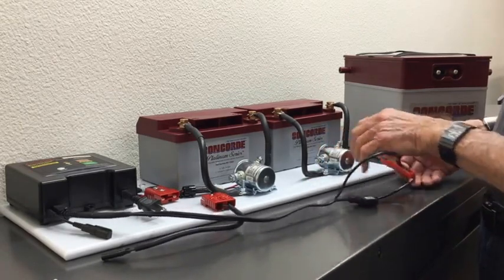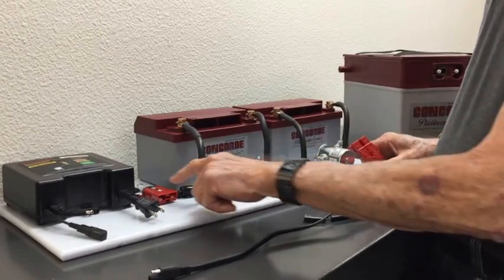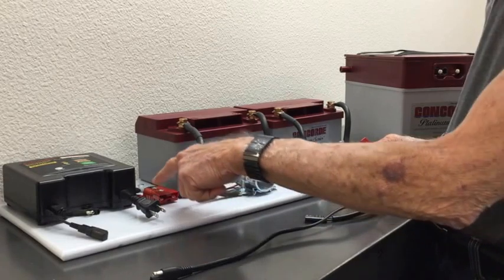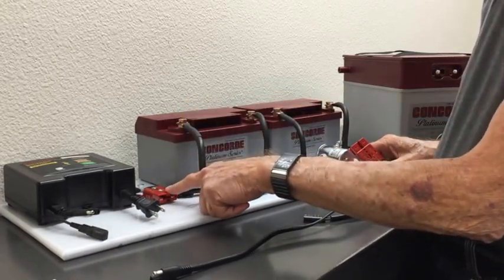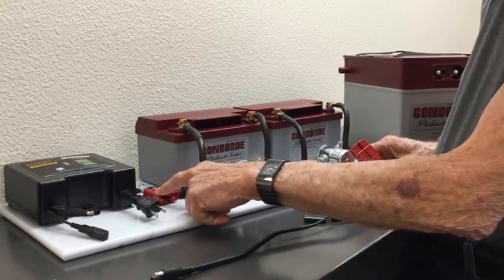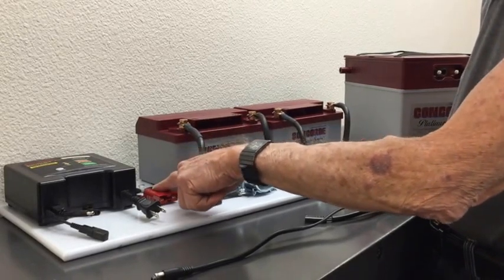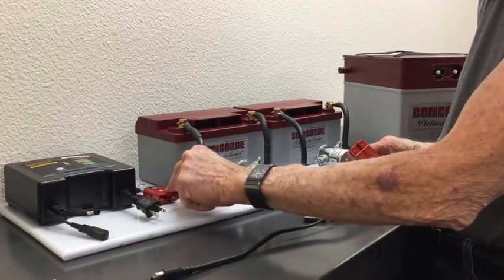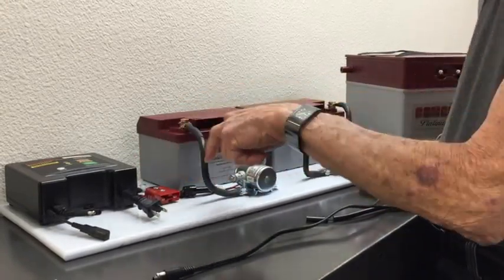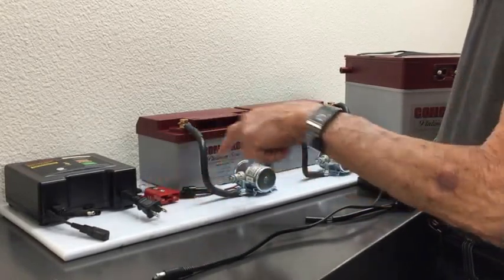The better way is to hardwire the Audio Authority enhanced flight hardwired kit in the airplane, with the quick disconnect mounted permanently in some convenient location — such as a baggage compartment floor or wall — where you would mount this quick disconnect with a couple of screws and nuts. The hardwiring is then mounted with cable clamps throughout the airplane, and might be 30 feet long depending on where the battery relay is located.